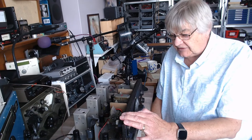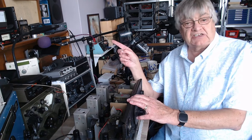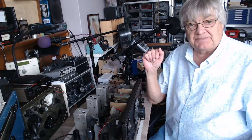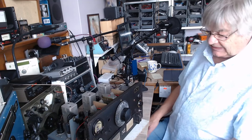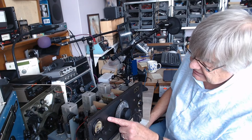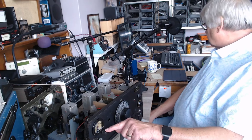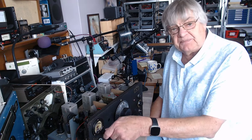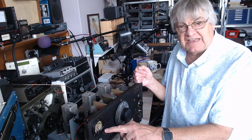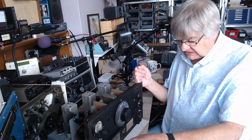The S-meter — I've still got problems with that. On an S9-plus signal like BBC Radio 5 Live from Southwick, about six miles away at two kilowatts up a mast, it should be end-stop here but it's only S3. With RF gain flat out you can see there's a hole where the noise limiter control should go — nothing in that hole. Someone scratched 'aerial trimmer' there. Below the S-meter on the right is the limiter control and it looks original. There's a three-way rotary switch which I haven't worked out yet.